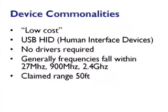The Bluetooth one has to pay licensing fees, has to pay for a chipset, so it's in the manufacturer's best interest that you buy the RF ones because they use very low quality chips. Most of the time it's one-way communication, and it's pennies on the dollar compared to Bluetooth chips. So there's no financial benefit for any of these manufacturers to create something secure. Even though there've been Bluetooth attacks, at least there's a base level of encryption and authentication. Whether that has been cracked or not, at least that's there. You're relying on something else rather than a proprietary protocol and algorithm, and security through obscurity, and hoping that no one's going to figure this out.